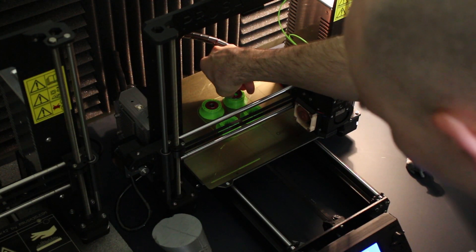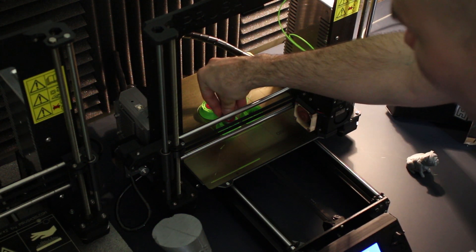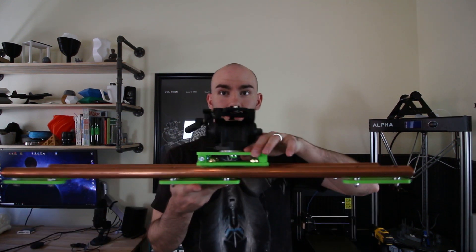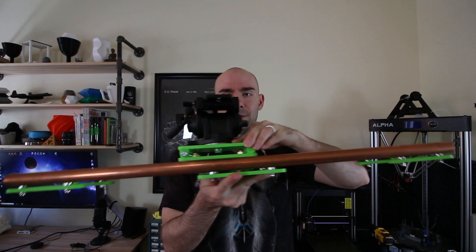It will wait for you until you come back and keep beeping at you continuously — it's actually pretty annoying, so don't do it overnight. I was then able to place the bearings in. You just need to make sure the top of the bearing does not overlap the top of the print, because then the nozzle would hit it and potentially really damage your printer. Make sure it's flush, and it gave me the ability to print out really cool bearings for this camera slider.